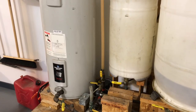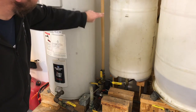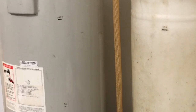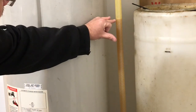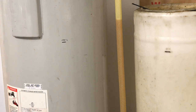So we've got our 100 liters in there. We open up the bottom valve all the way, the top valve all the way, then there's free flow through this tube. This tube acts as a sight glass effectively, so you can see how much oil is in the machine. There is a 100-litre marking on the tank that I've carefully measured before, and the sight glass will eventually come down to here — that's 100 litres, that's the batch of fuel we're going to make, starting with 100 litres of canola oil. So we've got it loaded. Next step we'll be starting the actual processing of the fuel. Join me in the next video for everything that happens in our processing tank. Thanks for watching.